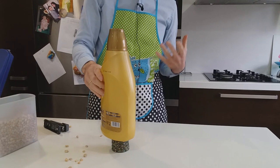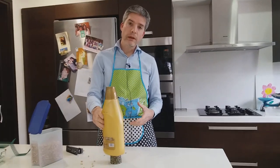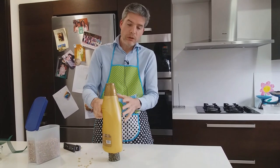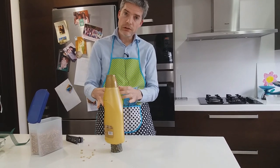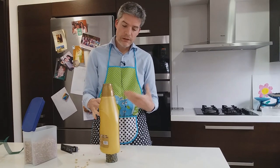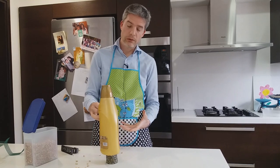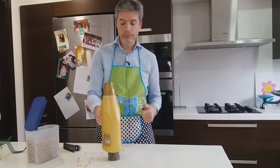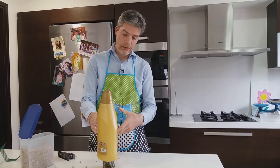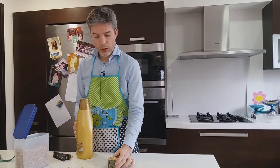The reason that the chickpeas can support that quite substantial weight is because they are being confined by the geogrid. As we compress the chickpeas they want to expand laterally, but that is resisted by the tension in the geogrid — that is called a hoop stress. In effect, that is giving the soil or the chickpeas tensile strength, giving it a cohesion when acting as a composite. Also, the higher confining stress means it would actually be stiffer than if the geogrid wasn't there.